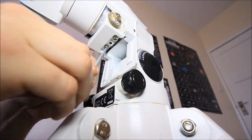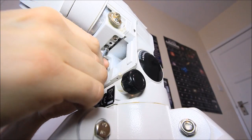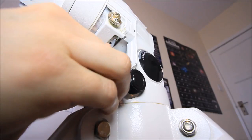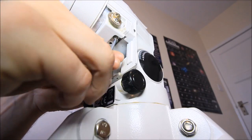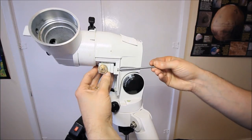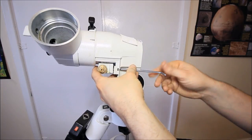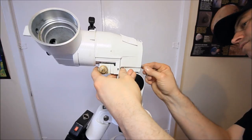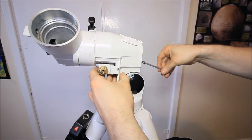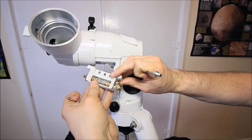Then remove the bottom of the RA axis worm drive — remove these bolts using the 4mm allen key. This head may rotate, so if it does move, hold the head. Hold the RA axis motor drive, slackening the back screws and supporting it. Do the same on the other side — that's both screws removed and the RA axis worm drive disconnected.